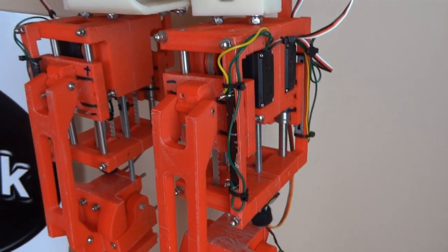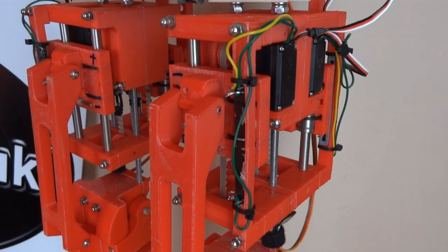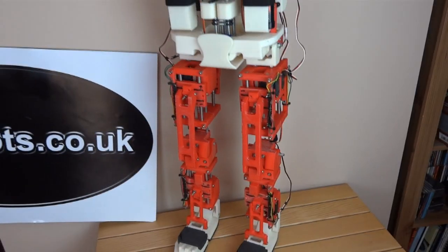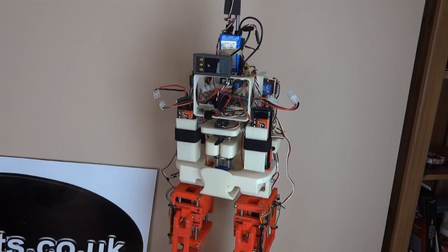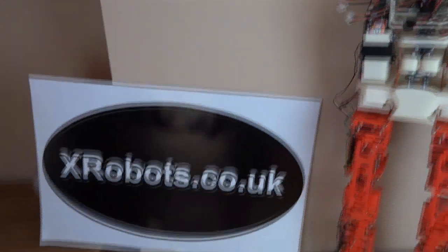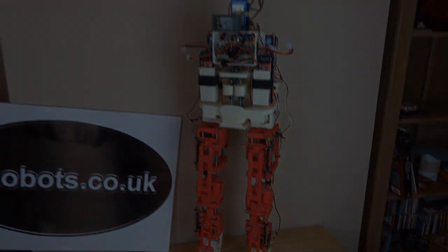All together it's a bit messy. The motors are 15 kilogram per centimeter of torque with metal gears, so fairly hefty ones, and I 3D printed the sprockets for the belts. It kind of works as you can see — it's a bit wobbly and a bit unpredictable — but this is part 11 and Android 12, so you can check out my videos and my website xrobots.co.uk for the previous 10 Android projects. The development goes on.